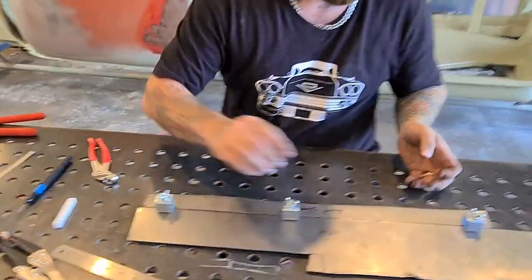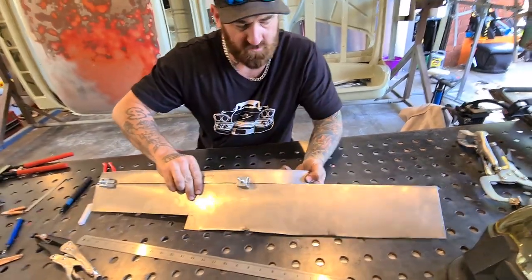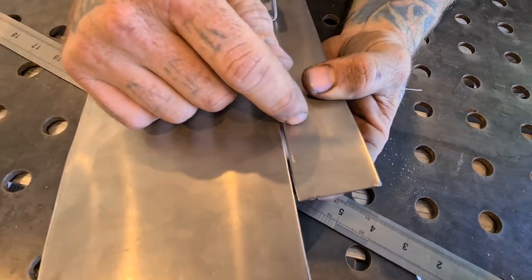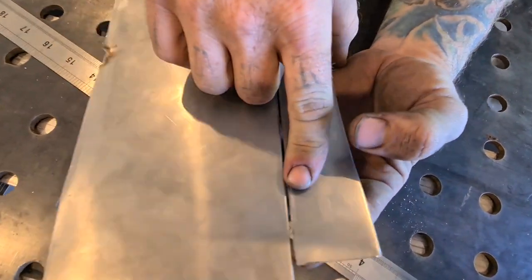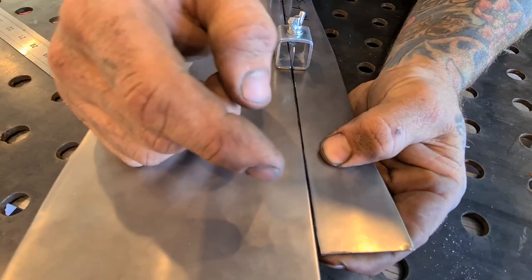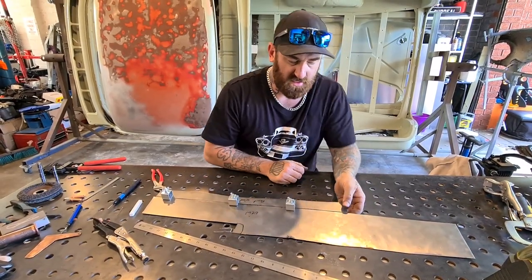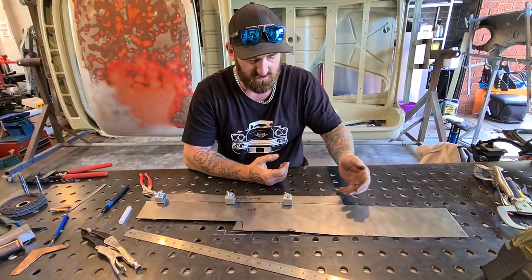Another key thing with fitment: if you've got a piece of metal sitting with a big step between the two in a relaxed state, don't just push it up and weld it. The tension will make it meet halfway and you'll end up with dips and warps. You want it to be as close to the correct shape as possible before welding — put in the extra few minutes to get that sitting nicely without tension. It'll save you 15 minutes of cleaning back welds and trying to work out a dip with a hammer and dolly.